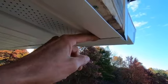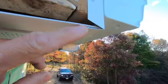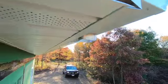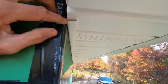The return bend just takes a couple extra minutes and literally only uses about a half inch of metal. Then we put F-channel right here — it's notched out for the blocking, but the rest of the way down has F-channel. I'll show you what F-channel is.